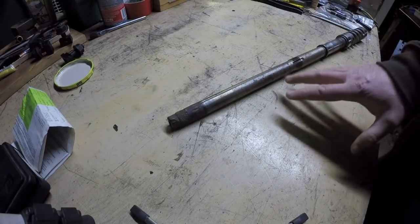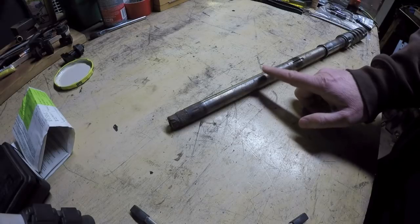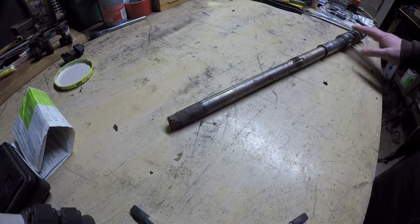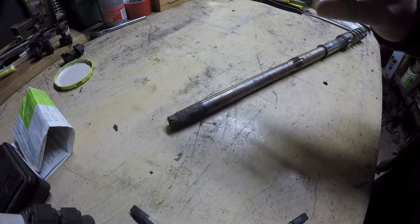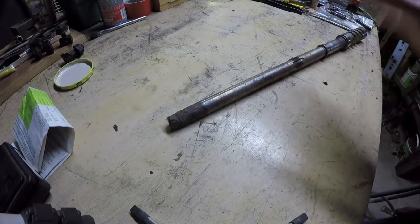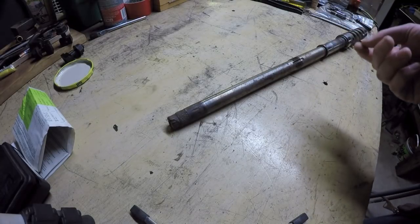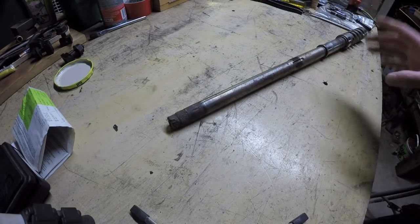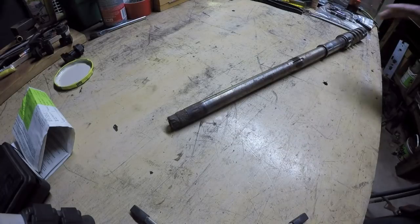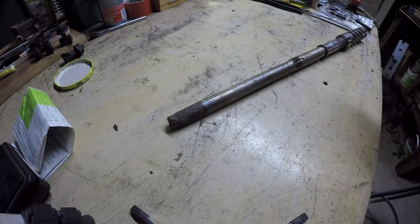So I thought about my choices. Obviously making this whole shaft new — we just talked about that, not going to do that. Choice number two: try and find a replacement shaft. Occasionally these pop up on eBay, but it's hard to get any of the internal components to this power steering gearbox because most junkyards and salvage yards that have used parts want to sell a used box complete. They don't want to break it down, which is why I ended up having to cobble together and make my own little roller bearing. The parts are no longer available, and no one would sell me that part — every person that had one had it inside a box they weren't going to take apart. And we were back to a thousand dollars for a used box in unknown condition.